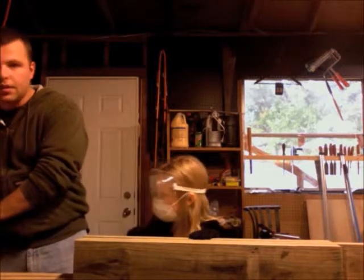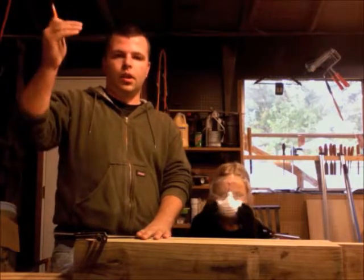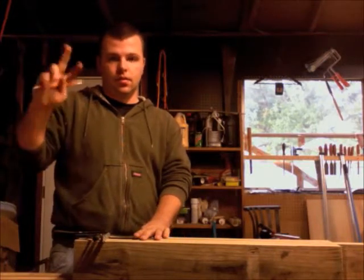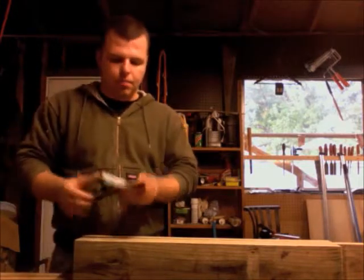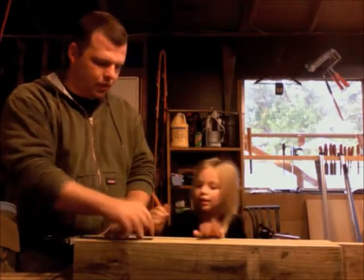And put the same thing on the other leg. Alright, so I'm going to have a 1/4 inch shoulder at the top and the bottom of the stretcher. So that means 2/4 is a half, so I'm going to have 3 inches in between. So I'm going to mark this up to 8.5 inches. Mark that right there.